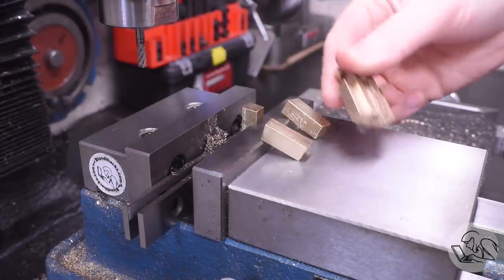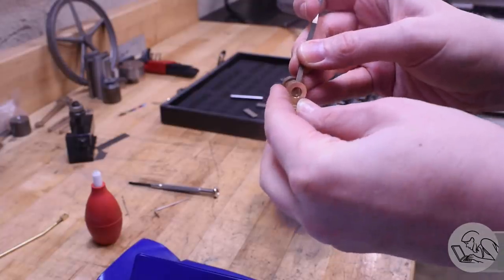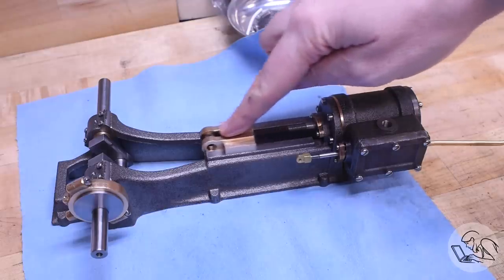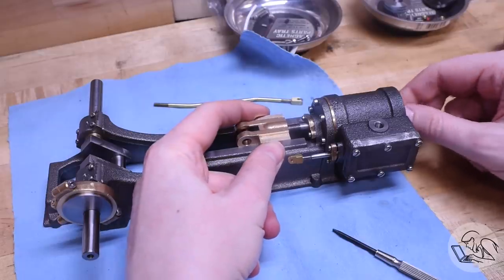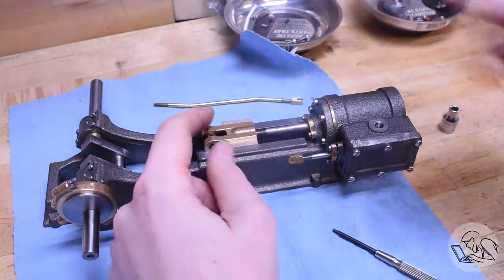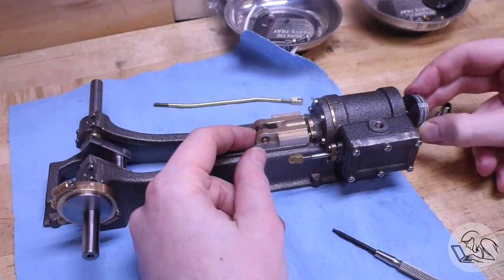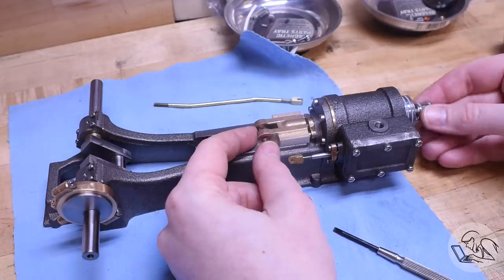The packing blocks have done their job - that only took a couple of minutes and was worth doing. It's always a question of how much fixturing time is worthwhile - always kind of a judgment call. I can deburr this part now, and it still fits on the rails, so we didn't make anything worse. Now the real moment of truth: let's thread the piston rod in and see what happens. That moves well - and the real real moment of truth is after the piston is installed, because that will tell us how good all of that alignment effort from previous videos really worked.